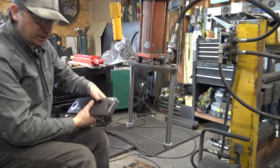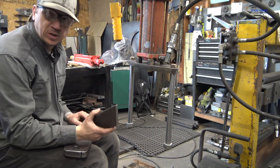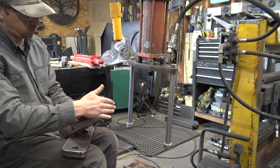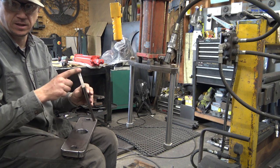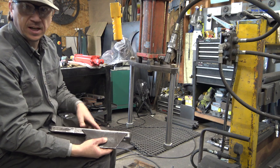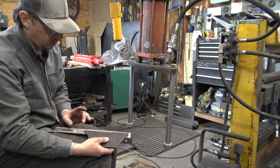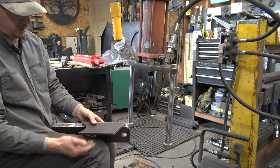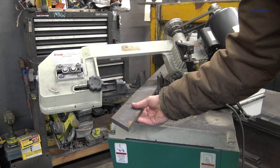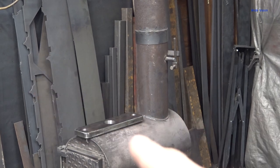Okay, so I think what I'm gonna do on this is I got some 1/2 inch by 3 inch flat bar, and I think I'm just gonna take it to the bandsaw and cut it at a, I don't know, 60 degree angle. Put it on the side here, put some beads in here. I won't weld it solid by any means. And yeah, that'll be my side gussets. To get this plate pre-warmed,